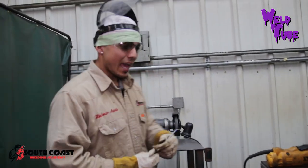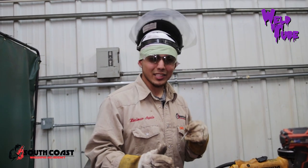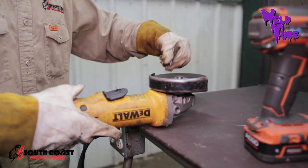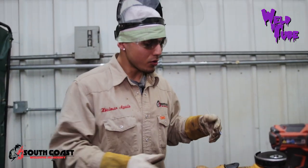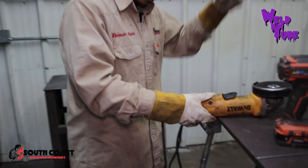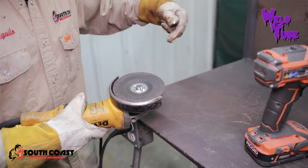So I showed you how to do it by hand on the tungsten grinder and with a drill. Now there's another way to sharpen your tungsten — it's very common, but it's a bit of a safety concern, so I'm still going to show you regardless. Grinding it with an angle grinder: turn it on and go slowly but surely, turning it little by little just like you did on the tungsten grinder. In the field they don't really allow this because of the safety hazard, but it does work fast when you don't have enough sharpened tungstens and nothing else is available. I wouldn't recommend it in the field, but try it at home — just be careful, and always wear your PPE, face shield.